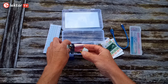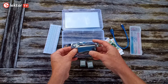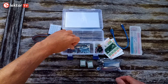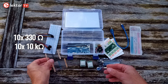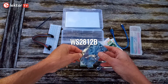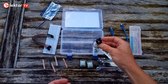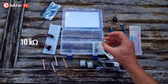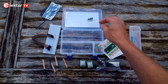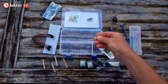There are also two PIR sensors needed in chapter 7, an LCD, and some more jumper wires. Resistors — 330 ohms and 10K, 10 of each — a 40-pin header strip, a ring with 12 WS2812B addressable RGB LEDs, sometimes known as NeoPixels. In the small compartment is a buzzer, a potentiometer, a little bag with pushbuttons that are not listed in chapter 3 but needed in chapter 4. Finally, 20 LEDs in 4 colors instead of the 3 as listed in chapter 3, and 5 of each.